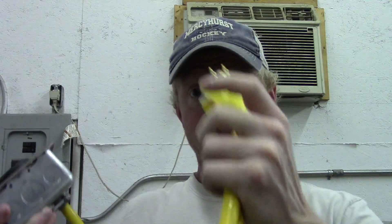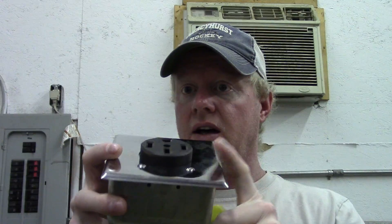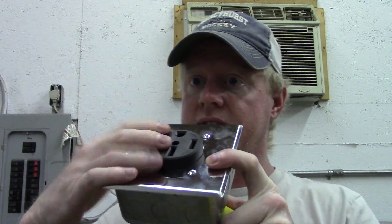We're going to finish this and do a test. I'll show you real quick how to test to make sure this is all connected correctly. It should be really simple if you're using standard extension cord. It's basically green to green for ground, white to white for neutral, and black is typically your hot. Depending on what kind of connector you use — this one was purchased at Lowe's and it's a 14-50R 50-amp connector.